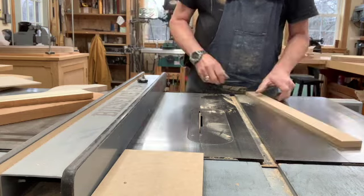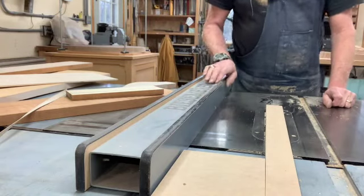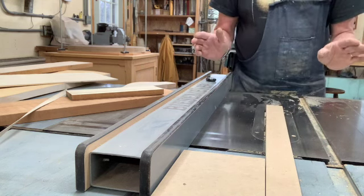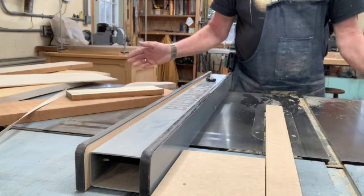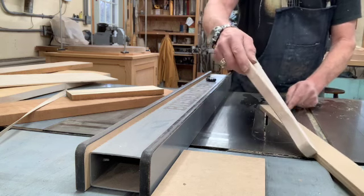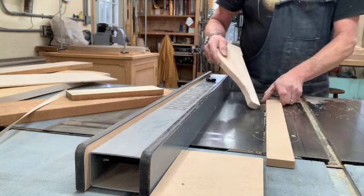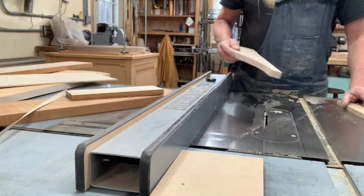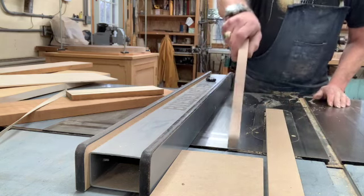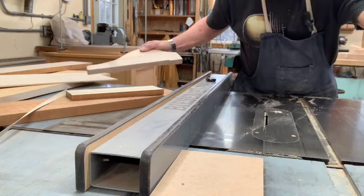This piece cut off cannot hurt you. The offcut piece also shouldn't be able to hurt you, but if it sits there, please don't touch it until the saw stops. Or if there's plenty of clearance you can carefully kick it out of the way — but be very careful. If this end is into the blade and you kick it, this end could end up in the blade. Neither one is a good situation. Best case scenario if a piece lays there: shut the saw down or find a safe way to remove it.